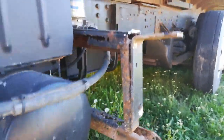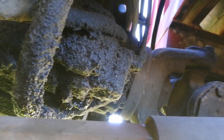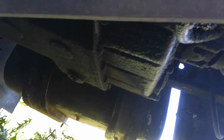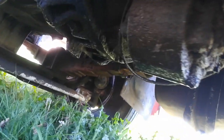Time for new steps. While I was under here, I'm not sure what the leak is — it's not super critical because I'm not driving a million miles — but I've got a fair amount of oil coming out of that. Now I'd say that's off the transmission, but then it's further up here — that's the PTO. So I'm leaking somewhere there, and then further up I've got some off the engine as well.